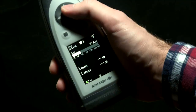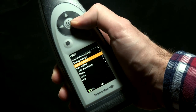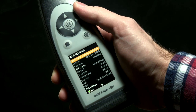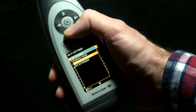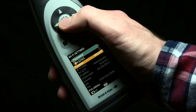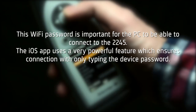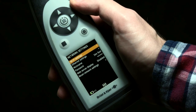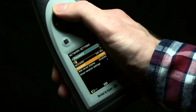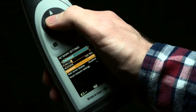To set up the hotspot, go into the SLM meter settings, down to system settings, then network settings, then Wi-Fi settings, and select Wi-Fi mode — act as hotspot. Set your Wi-Fi password (in this case abc12345), go back to the menu, and set the device password to abc123. We'll need this device password for connecting to our mobile device.